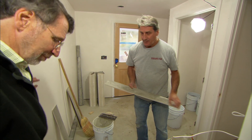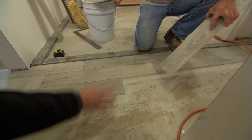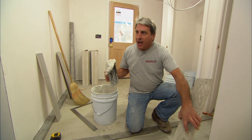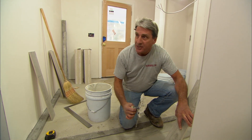Now I know you've done the typical prep on the floor — there's cement board below it, a layer of thinset. And now you're ready to install the pieces. Anything special on the installation? Well, we're going to keep it instead of a running bond pattern, we're going to lay it just like flooring — keep it a third so there's no joint the same.